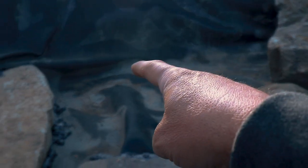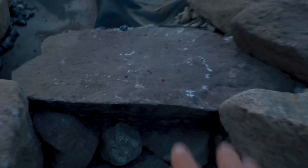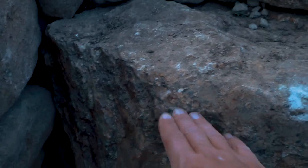So that means we gotta bring a rock in here and frame this and put a weir stone here that's gonna let that cascade into here. Then we've got a couple rocks placed in our stream bed. They're gonna kinda kick the water around, get a lot of nice water movement going through here and coming off into the pond. And this is gonna hit from here down to this lower rock, which is gonna be just above water level. So it'll hit here and just kinda run into the pond.